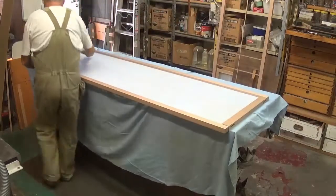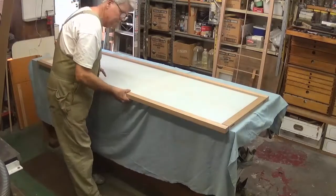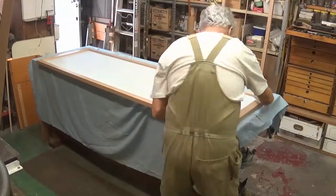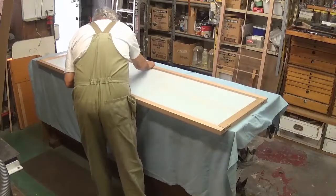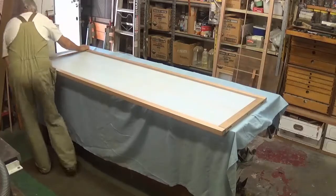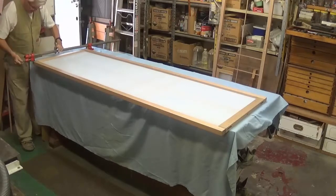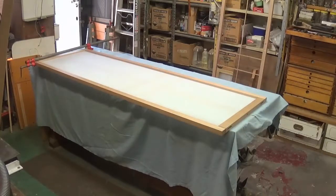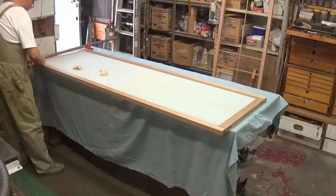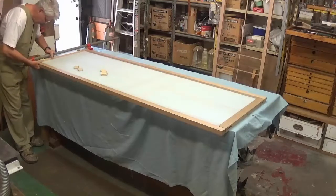Because the spigots are 15mm long, they can be inserted into the frame before the acrylic actually touches the frame, since the acrylic only goes 5mm into the frame. I make the spigots 15mm long for that reason. This is particularly important when you have multiple horizontal kumiko pieces, which have to be inserted one after the other. Small pads are used to protect the finished shoji from damage by the clamps.